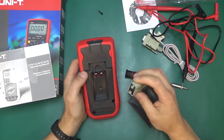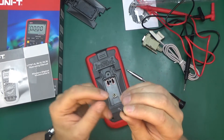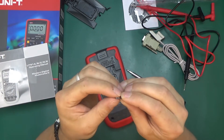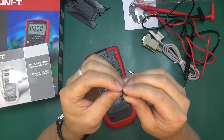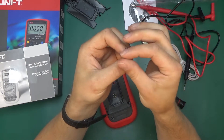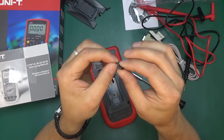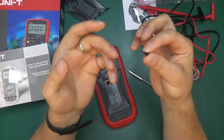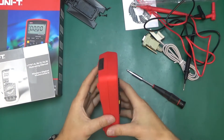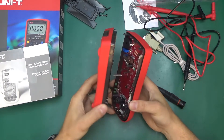Let's remove the two other screws. Even though these are self-tapping screws and you can see them already chewing up the plastic, they've got quite a bit of bite. Provided you're careful when screwing them back in — just unscrew until you hear it fall into the groove previously carved into the plastic — those should last quite a long while. You just have to pay a little more attention not to cut a new thread in the plastic every time.